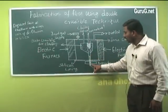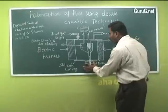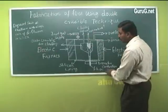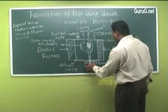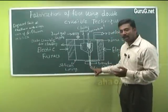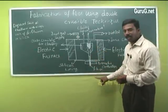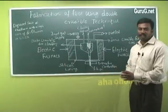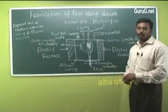The fibers are drawn in the form of wires through the outlet of the crucible. The diameter of the fiber can be maintained using a diameter control, so a desired diameter can be obtained. Finally, an optical fiber coated with a polyethylene jacket is obtained. This is one of the cheapest and most effective methods of manufacturing all types of optical fibers.